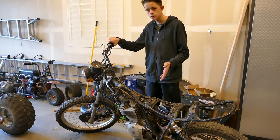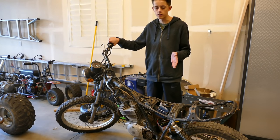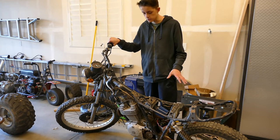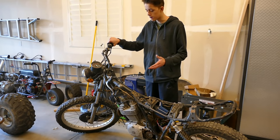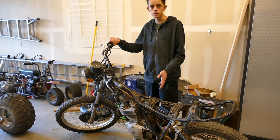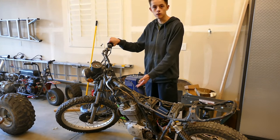Buggy, I have a 1981 Honda XL500s, single cylinder, 500cc, air cooled engine. I got this entire bike for $150 and it's in pretty good condition. It kicks over, has compression, it doesn't have spark. I already bought a CDI for it, that didn't fix it. Pretty sure I need to buy an alternator stator for it because I'm not getting any power at the alternator